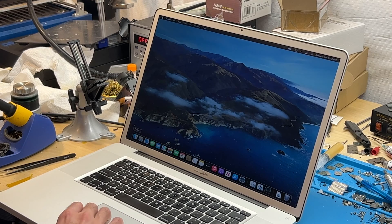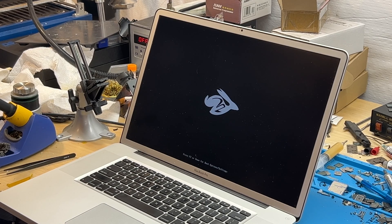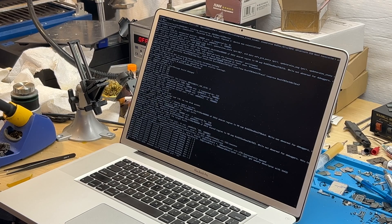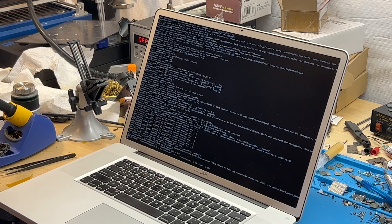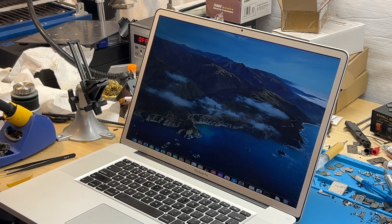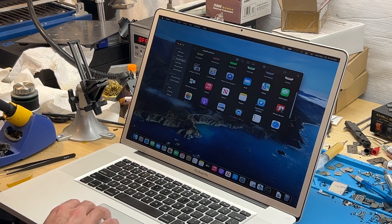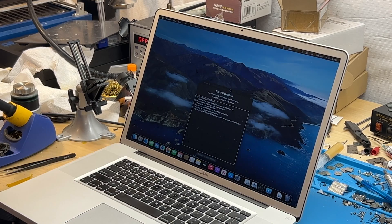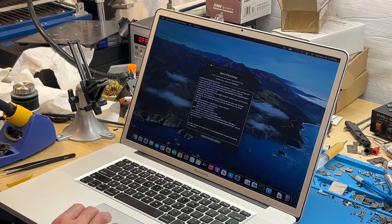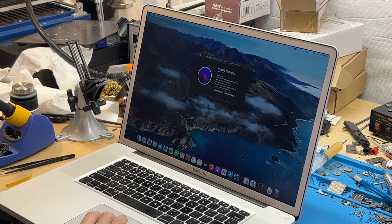Because it's snapshotted, I can undo the patches. So now when you run the patches, what kind of patches do you need to do? The Ivy Bridge patch — you patch it like a 2015 MacBook Pro. OpenCore Legacy Patcher takes care of that. It is weird that the screen is now light gray — the Apple logo screen. That's normal for verbose booting; if you go back to non-verbose it won't do that. And there we go — full Metal graphics acceleration with Intel HD Graphics 4000. That's so crazy.